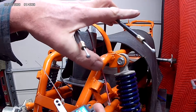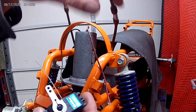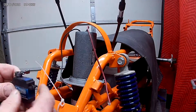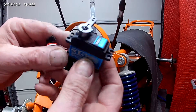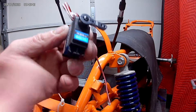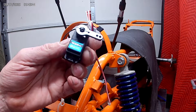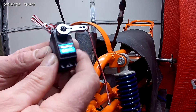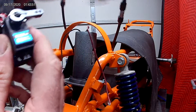It looks to be two centimeters out, so that's 17 kilograms of force — about 40 pounds. I'm not sure what a person can pull on a brake lever, but I would imagine this could probably pull as much weight as a human hand. The vehicle's going to be lighter than with a person on it, so I think it won't take a whole lot to stop it. So I'm going to install this thing.